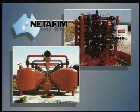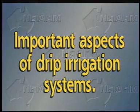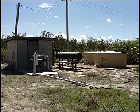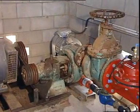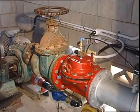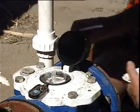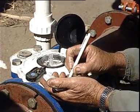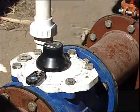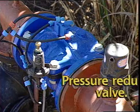Because drip irrigation operates on low pressure at relatively low flow rates, it allows for the use of small pumps, providing efficient pumping with a low demand on energy. A water meter provides accurate information about the rate of flow and the amount of water in the field, and can also alert the grower to blockages or leaks. Because water pressure is controlled with a pressure reducing valve, constant pressure providing uniform flow to the lines and drippers is not a problem.